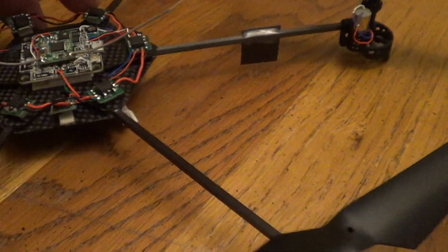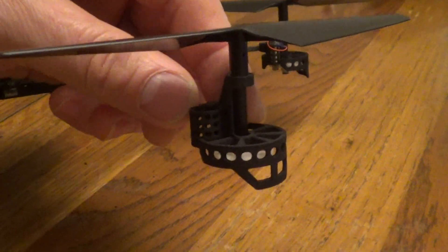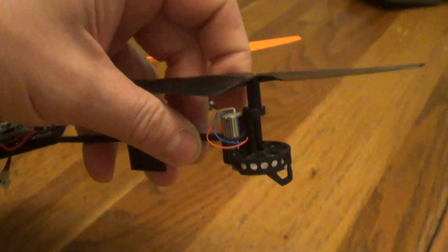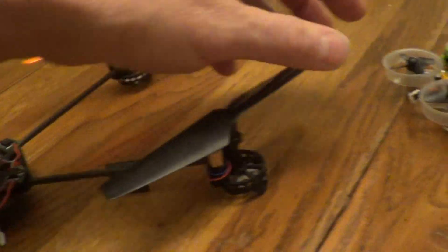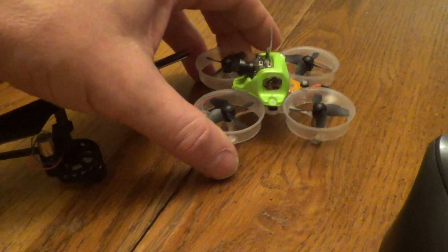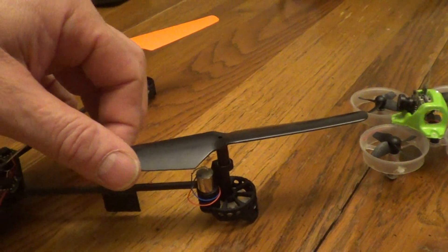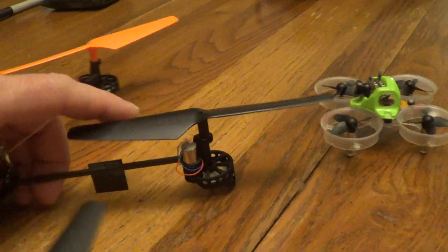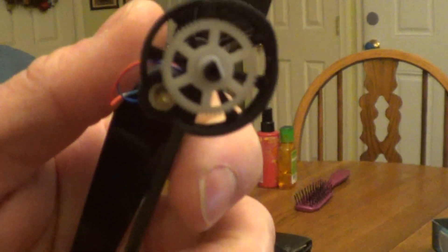In this design, these are 3D printed — they're available and pretty lightweight. I was able to look up thrust testing, and right here you're talking about three grams per watt of thrust, whereas here you can get about 14 grams per watt of thrust — about seven times better efficiency going to the bigger prop diameter with gear reduction.